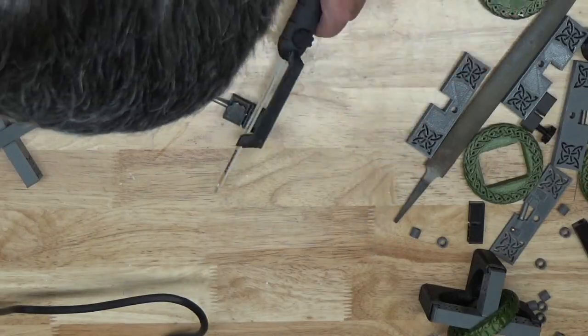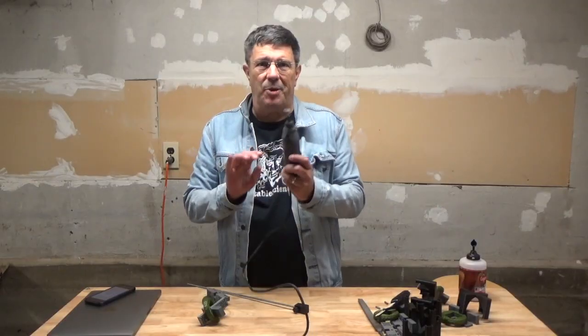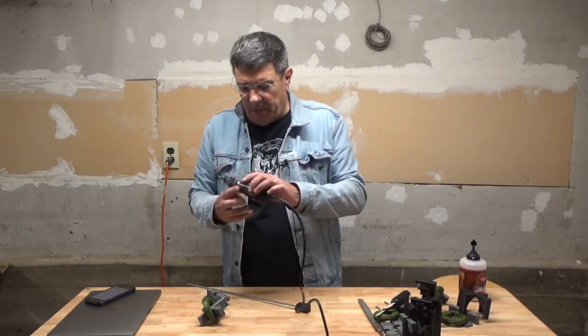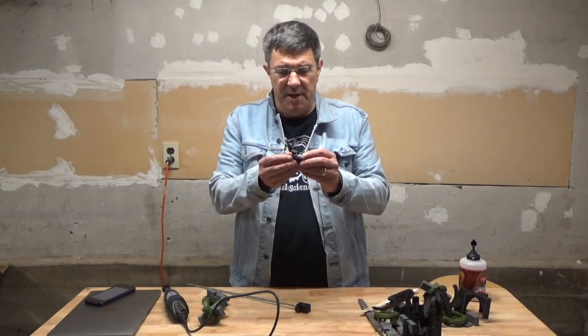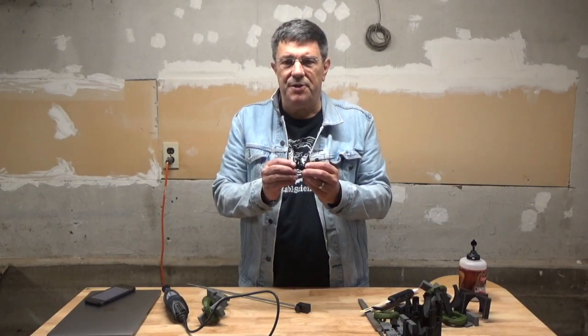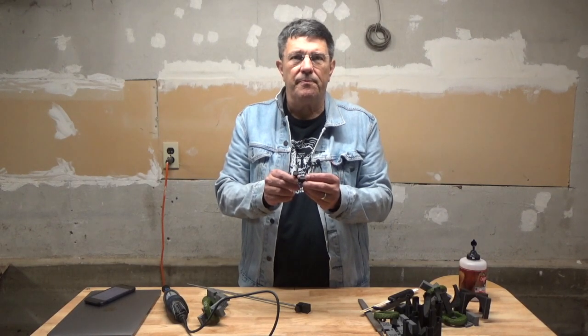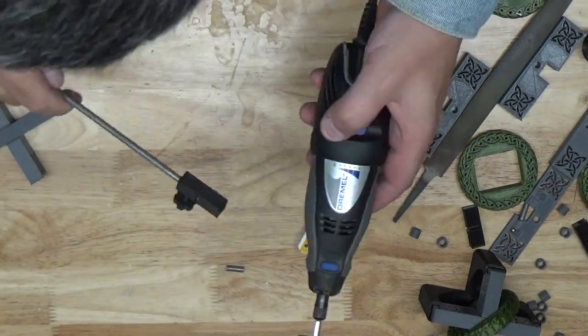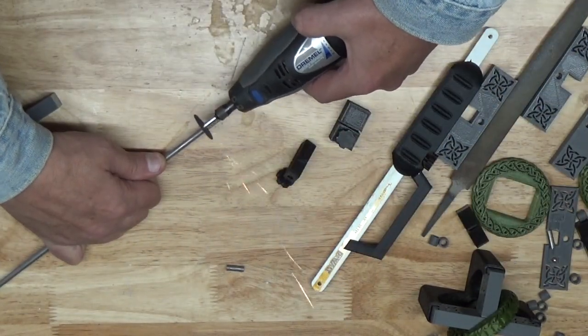There's a link to that project right there. You can make incredibly light work of cutting the rod if you have a high-speed cutting tool like a Dremel and a cutting wheel, and we've supplied a smaller jig for that so that the jig doesn't intrude too much on the clearance required by the cutting wheel. If you are using a Dremel, go slow. If you don't, the steel rod will heat up too much and melt the plastic of the jig.